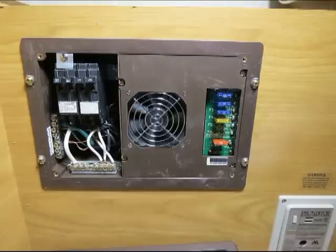At this stage, if you've got everything cleaned up, you didn't have anything laying around, you can go and plug in your shore power and test to see if you've got electricity in the converter. Hopefully everything's good and you're all right. Plug in your shore power, throw your main breaker, your 30 amp breaker, to on, and check if anything's on, and then throw your other 20 amp breakers on and see if the microwave or the fridge or whatever you've got on there works.